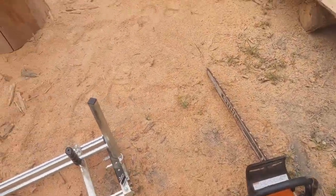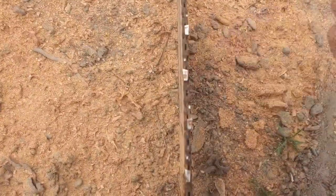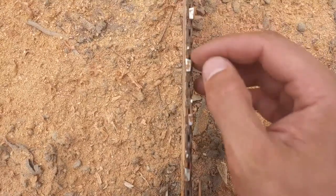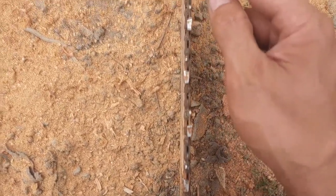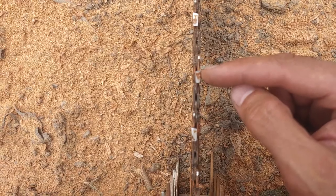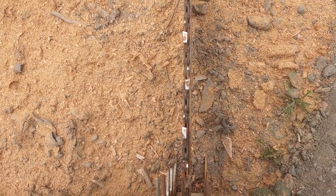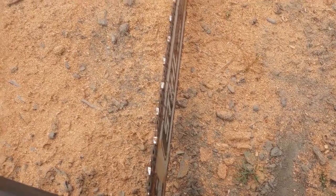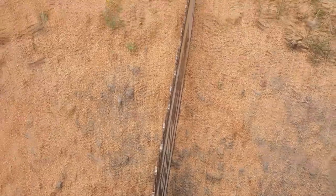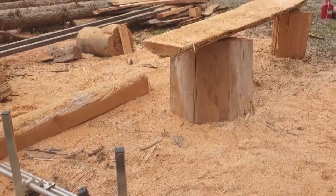I've got that one and that one left to do and I've got a stack of boards there. I've got to sharpen my saw, but I wanted to show you this ripping chain. The angle on these teeth is much shallower than a crosscut chain you'd use to buck a tree — these are about five to ten degrees, whereas a crosscut chain would be 25 or 30 degrees. That really does make a difference. I've tried it both ways and day and night, the ripping chain is the way to go. So I'll sharpen my chain and then finish the last couple of flitches.